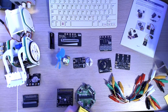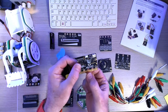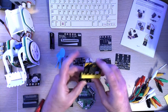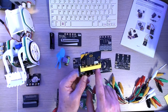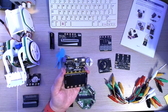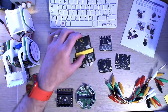I was talking before about the microbit. Let me grab my microbit that's just over here. We can see that we've got all these different pins there, but really we can only grab hold of these 5 pins there, one of which is voltage, one of which is ground. Plugging into this connector means that we're able to get access to the full range of pins, and this breaks it out to an I squared C bus, so it's got the right pins selected, and we've got the other ones on the other side for, I think it's SPI, sorry. So yeah, there's an MB underscore connect for that one, and it's also passing on those five connectors, so we could still have this in the way but get access to those pins that we might want.